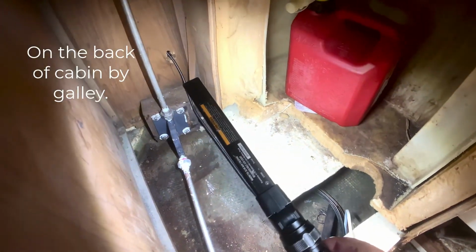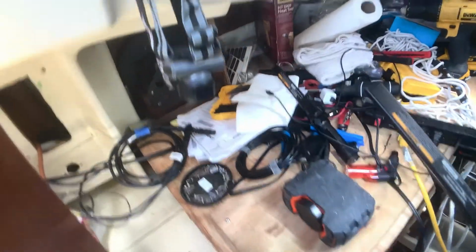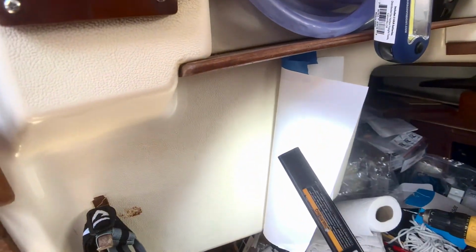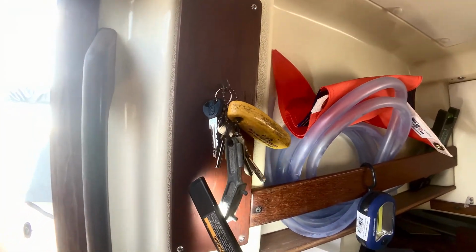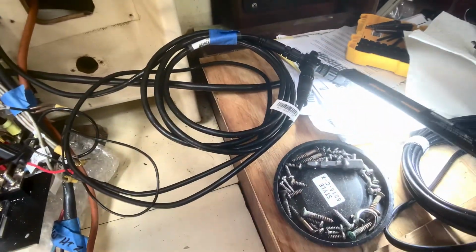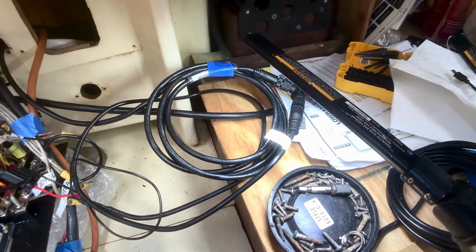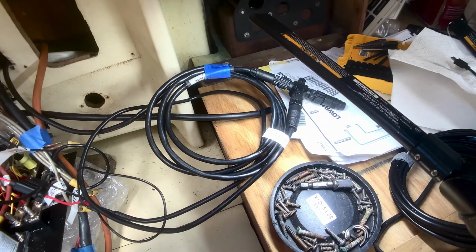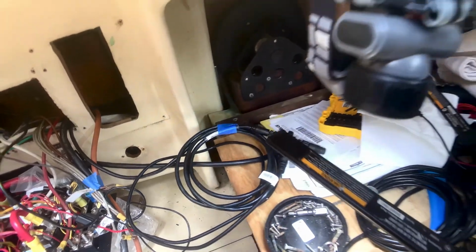All right, so you can see my cable right there running up outside into the outside bulkhead. From there it comes in on the inside of this wall and up. And right behind here, there were the 2 holes on the back side of the instruments. Over here in the electric panel, we fed the wire to here. That's our terminal. And we have a T fitting there, and we have some extra wire, so if we need to add things later, we need to rerun or move things around, we have extra wire to do that with.